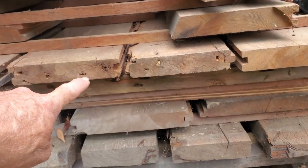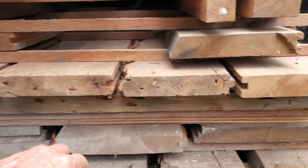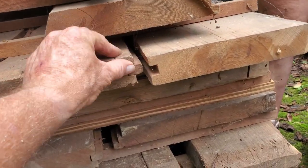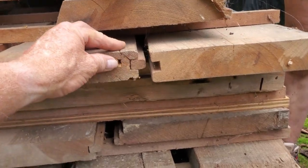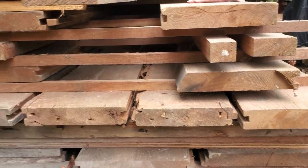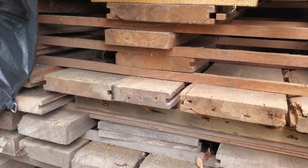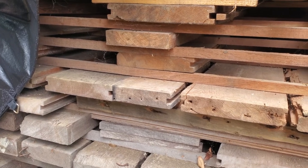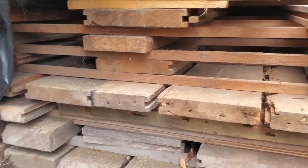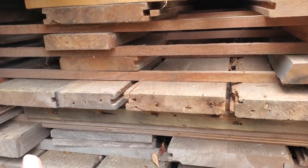All these boards here, back in the day, they didn't tongue and groove. They grooved, and then they put a tenon in there like this, and that's how they did tongue and groove. But these were stall boards to keep some bulls that were used at a local mill for hauling, or oxen, for hauling the wagons. So you needed some strong boards, but they were also lightweight.